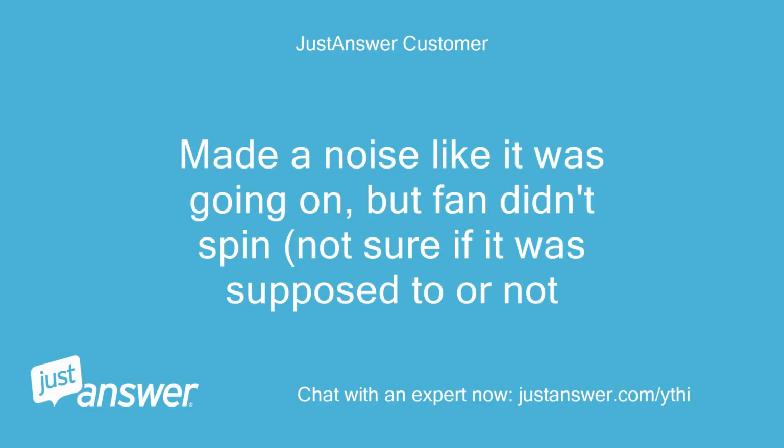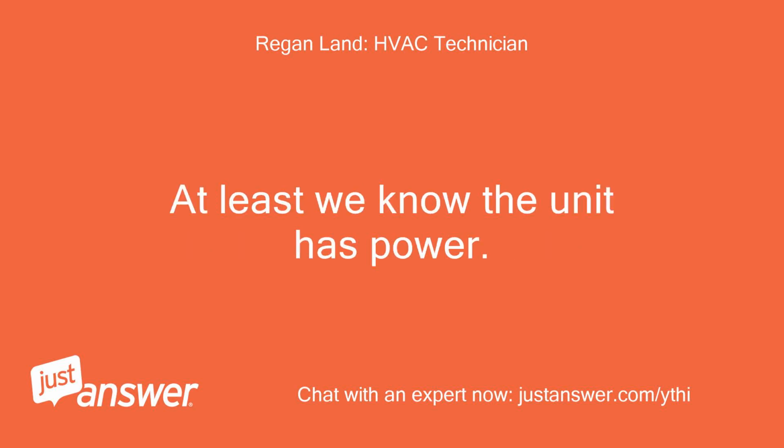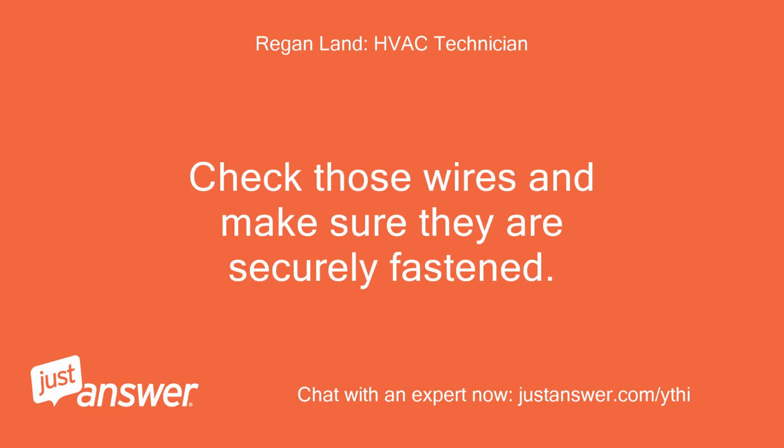Made a noise like it was going on, but fan didn't spin, not sure if it was supposed to or not. Okay, fan will be controlled by the board. At least we know the unit has power. Take a look at the lower left of the board. There are wires coming into the board marked A, B, C, and D. Check those wires and make sure they are securely fastened.